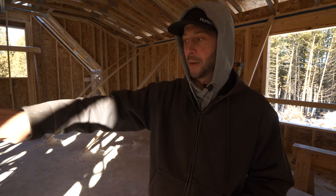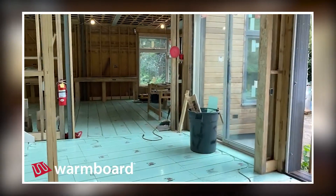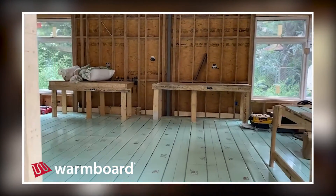The house is actually heated by radiant floor heat, running through the slab already. But because we had to do a mechanical room at the front of the house and a second floor, we had to do a warm board install. Warm board is essentially two layers of plywood that gets CNC'd at the factory based on the plans, shipped to us, and we install them directly on top of the subfloor with standard floors on top of that.